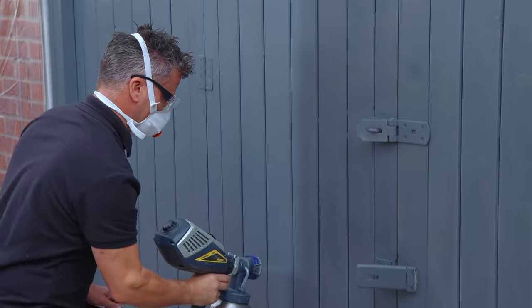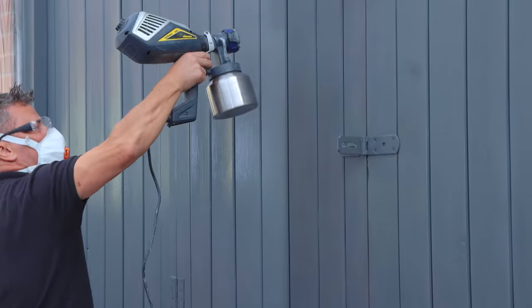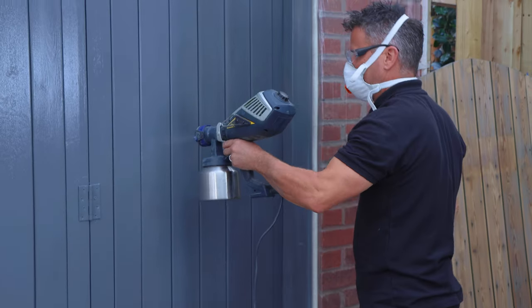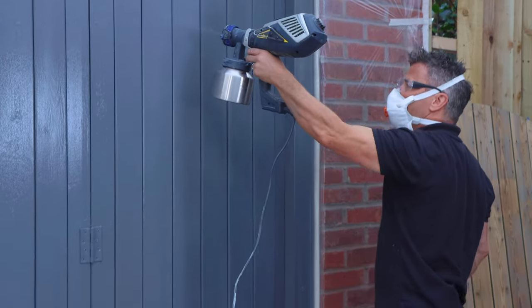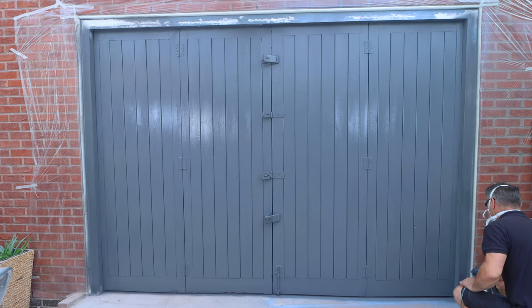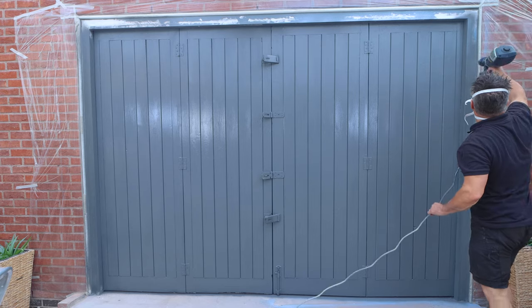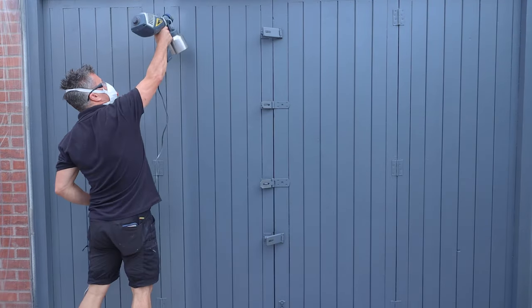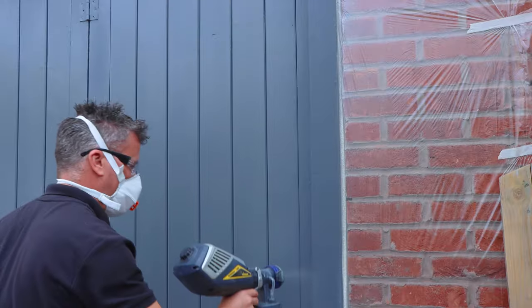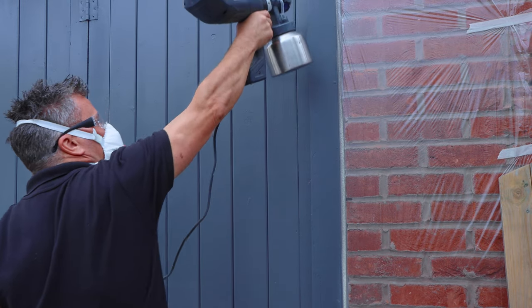I've diluted all of my paint and I'm going to apply my second coat across the whole area using my paint sprayer. Now it's had a couple of hours to become touch dry, I'm applying a third coat. Always remember, when you're diluting your paint down for a paint sprayer, you're going to need more coats. Two good solid coats applied with a brush undiluted is normally perfect, but when using a paint sprayer I'll do a minimum of three to four. That's four layers of paint applied with the paint sprayer on the main garage door using the smudge colour.